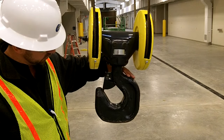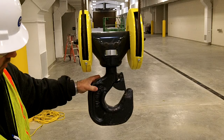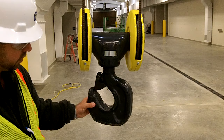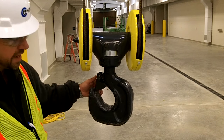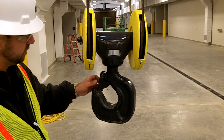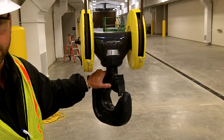When inspecting the hook, make sure that the hook latch is working properly. Visually inspect the hook — scratches are normal wear and tear, that's okay. What you're looking for is a crack or a deformation. If the hook latch ever springs — meaning it doesn't catch on the hook — that's a problem. It's an indication the hook has been overloaded. Do not use the hook in that condition.